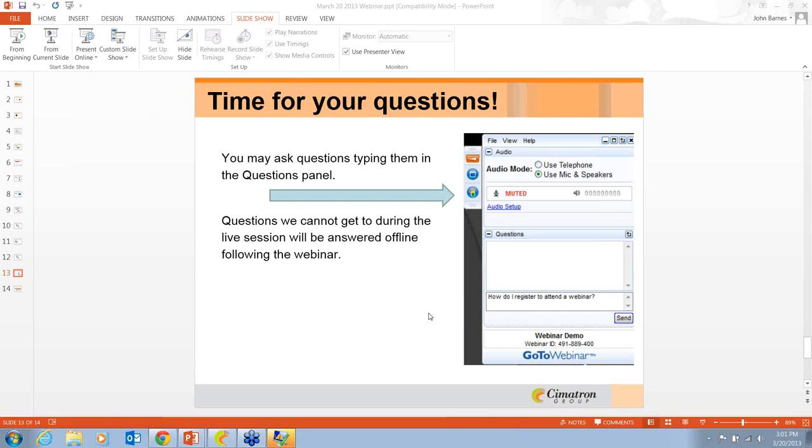Hey, Ken, here's a good one. Is the software capable of doing a runner balance for multiple cavity tools? Yes. If your mold is of multiple cavities or family mold, we are able to help you to find a flow unbalance. Then you are able to modify your gate location or modify your runner size to get a flow balance. Otherwise, if your flow is unbalanced, sometimes you pack one part more than the other one, and then you will cause warpage. The warpage quality will be different.